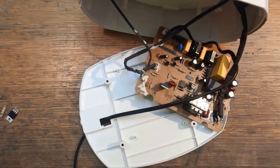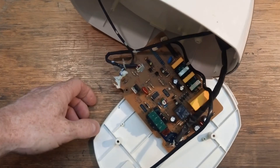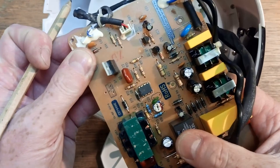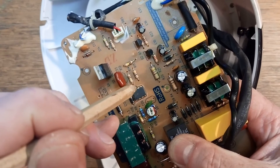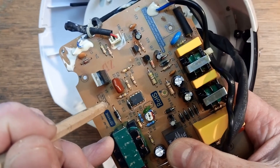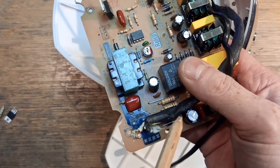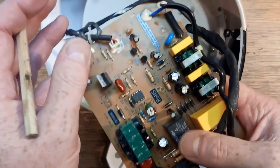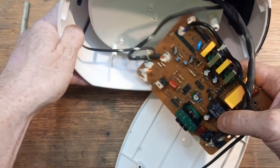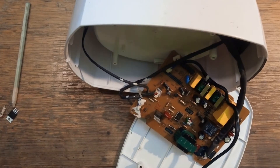Some water had got in somewhere, condensed, and basically everything was slightly damp. Looking at the board you can see a white tide line around certain areas, and around this spot in particular there was corrosion on the outputs — the main wire out to the piezo element, which carries reasonably high voltage and certainly high frequency. There was rust around a little diode here. Whatever was leaking had previously evaporated between uses, but because I used it several times in one day it didn't have time to do that.